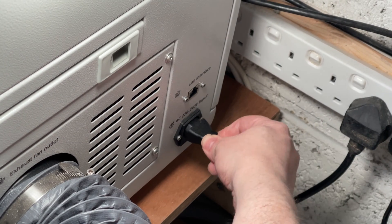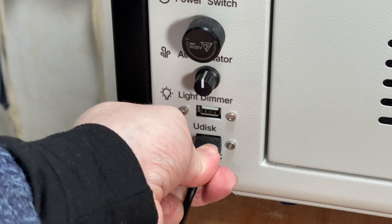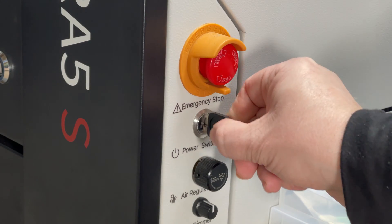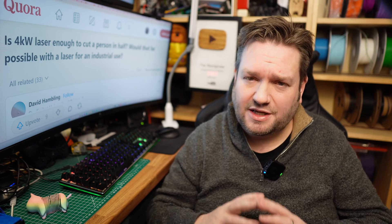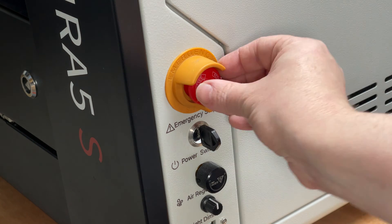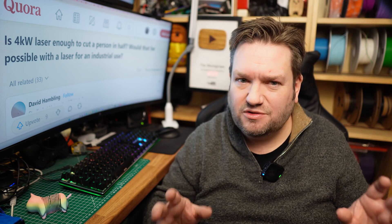We connected up the power cable and a USB cable to the PC running the laser. There's a key switch, handy for locking down the machine — maybe you've got curious children around, or perhaps a co-worker who wants to try giving himself a tattoo. My workshop is very secure so it can stay unlocked. Just turn the key switch, reset the emergency stop, and away we go — we've got power! When you first power up, give it a few minutes as the water needs to circulate and flow into the tube. You can take the cover off and watch this, which is really cool.